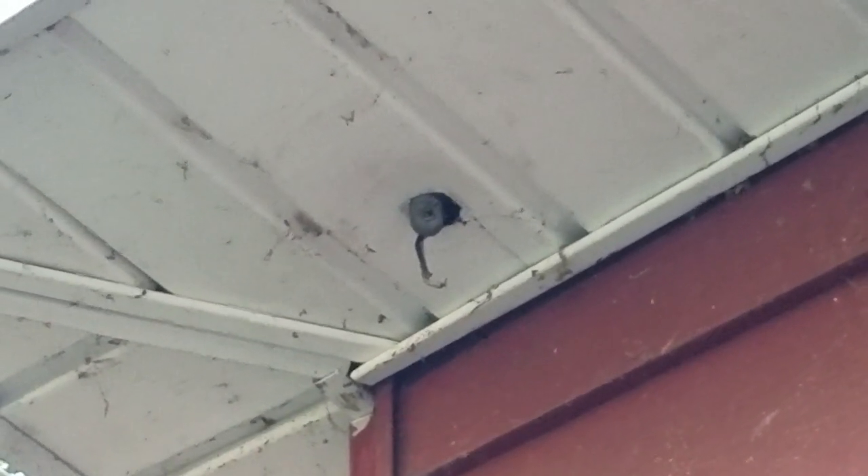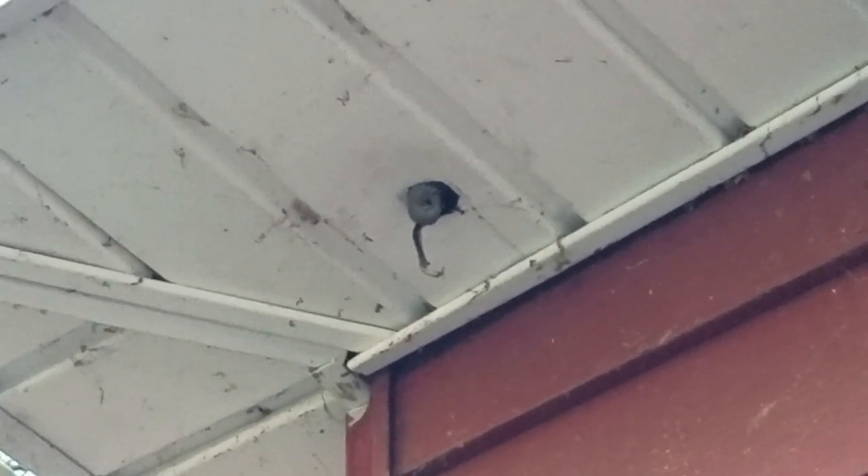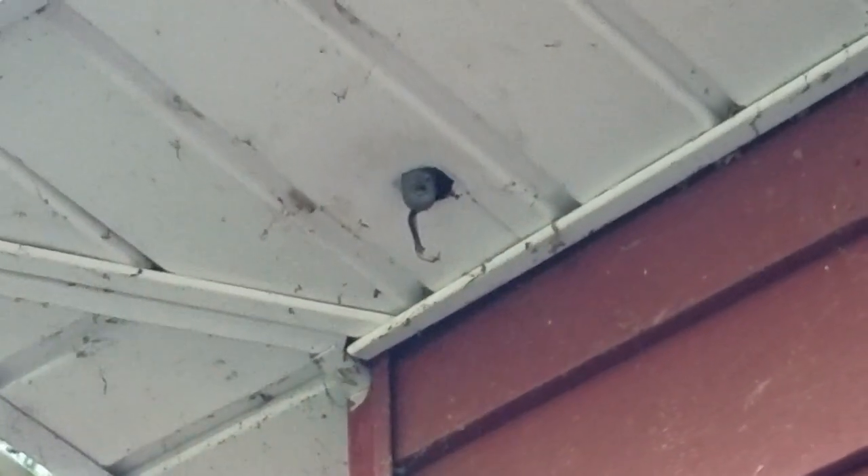Okay, so that's what I've got there. I was able to get the light fixture off and I've got about three inches of wires hanging down. I cannot get up in that soffit to get to the rest of the fixture, so I'm going to put the box right over the top of that and tie into it that way, and screw the box up through the soffit into the structure.